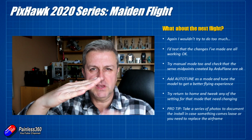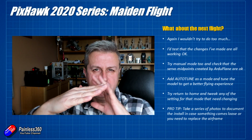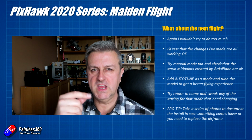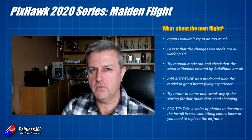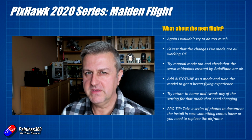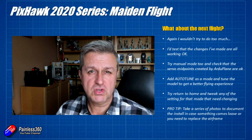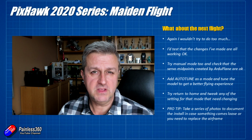I should be able to flick into manual mode and have much more aggressive flying, and all of the servo midpoints have changed. In fact, you might have noticed in that servo output screen, all the servo midpoints had been tweaked a little bit, and that was ArduPlane that had done that for me. I would also add an extra couple of modes so that you can flick into them.